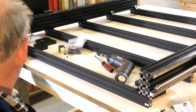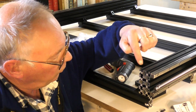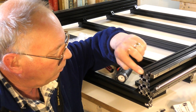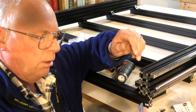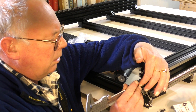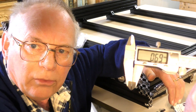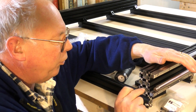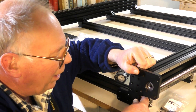What I have found on both sides is that this stiffener is actually protruding past the C-rail by quite a considerable amount — by 0.68 of a millimetre. Which means if you tighten all these screws up, this plate is going to tend to want to pull around.